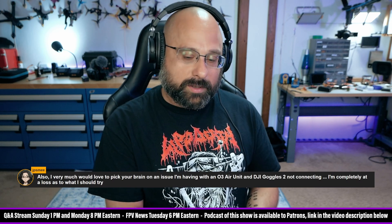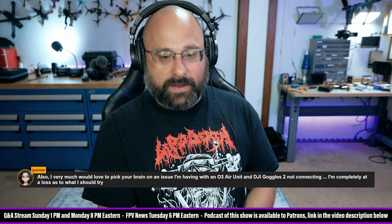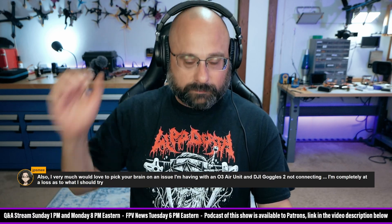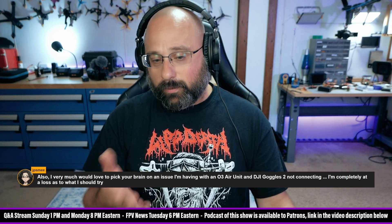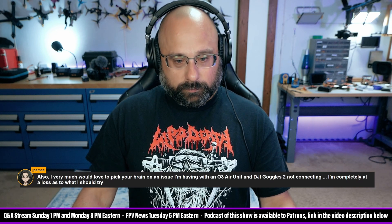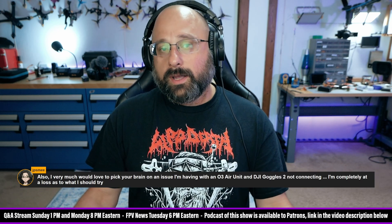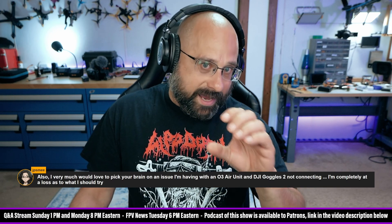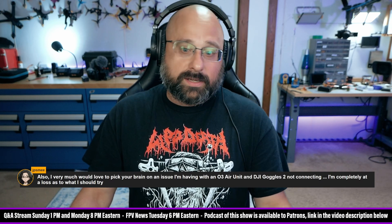Let's Fly RC says — good to see you, Sean — I've had multiple O3 air units lately that try to reactivate, then activation failed, and I've had to activate later to get into the menus. I don't think he's even getting to that point — he's not getting to bind at all. Is the O3 activated? The O3 will bind even if it's not activated. We're going to move on from this one. Feel free to email me — I'd say send me a video of you doing the bind process so I can see the LED on the air unit and what the goggles are doing, and I'll try to see what's not working for you.